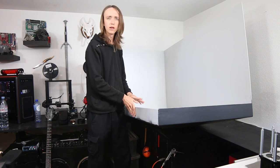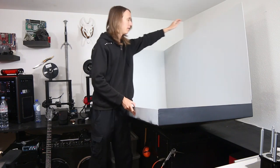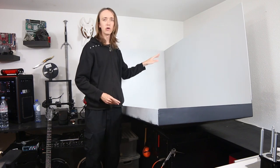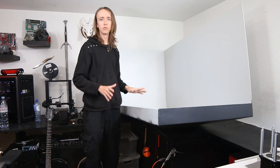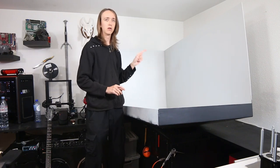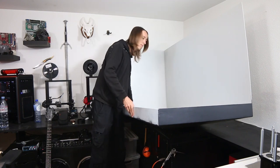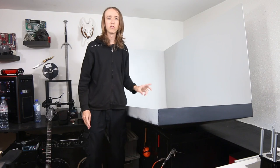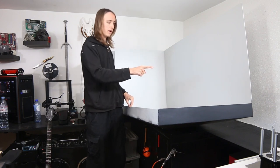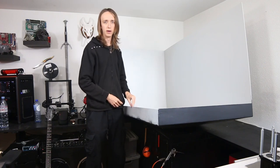This side here is already primed, but I need to prime the back side of this panel and also the back side of here, then just give it primer and then a coat of paint so it's protected from rusting. It doesn't need to be super beautiful back there, but it needs to be rust proof. Then I've got some little scratches and imperfections in different places that I need to fix up, but after that I think the enclosure for now is pretty much done.